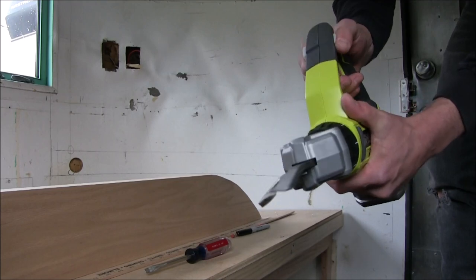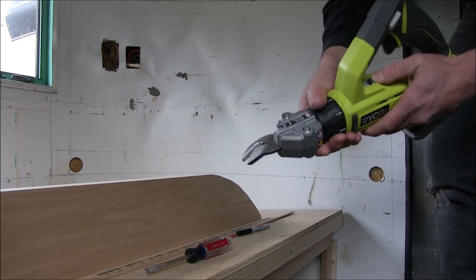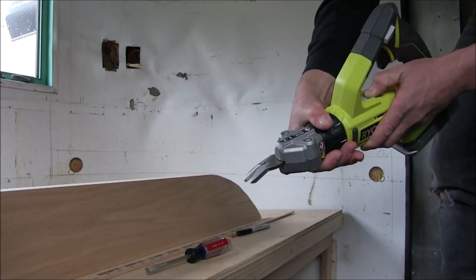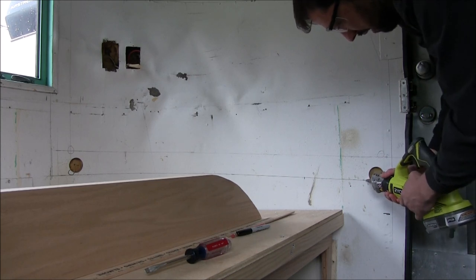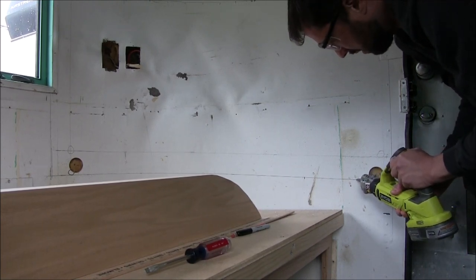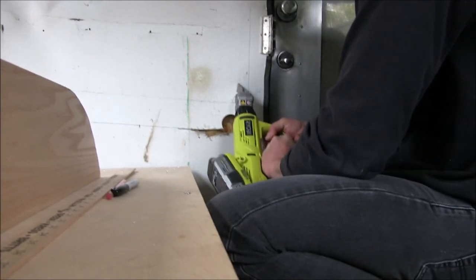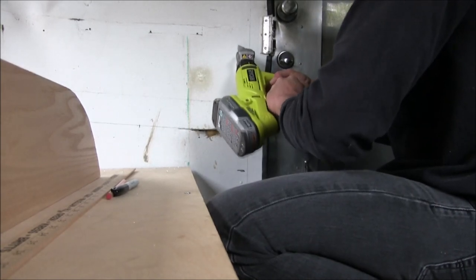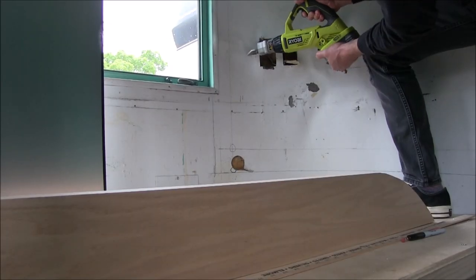So now when I run the shears along this line right here I can make the turn and go up. I'll grab my battery-operated shears — the head actually tilts so I can twist it around to get different angles by unlocking it here and twisting it. I want to get this angle here so the battery's not in the way. I want to come in like this, make sure it locks in place, and just run it along to the hole.